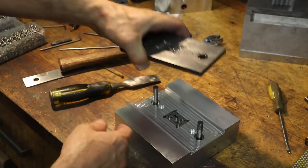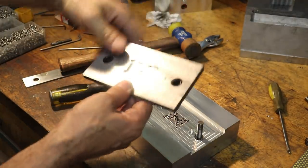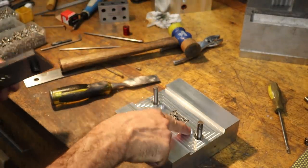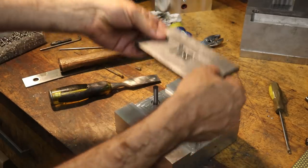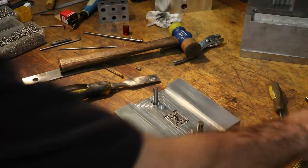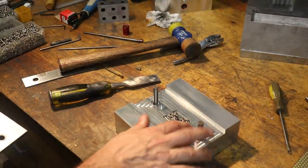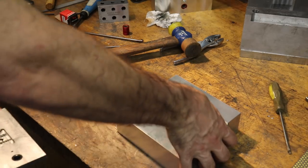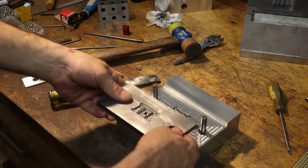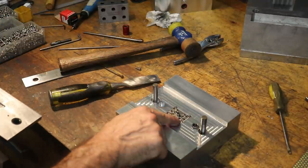This is the through hole that retains the stripper plate down. So when the mold closes, the A side of the mold is gonna push on this plate, and it's gonna compress springs inside of these pockets. And this plate is gonna seat down like we just did it, but I didn't have the springs in there for our test fitting. And this is one of the springs that's gonna go right in there. There's not gonna be much travel. Well, actually this one's too short. But there's not gonna be a whole lot of travel on this stripper plate. It's just to move up maybe 2 millimeters, enough to kick the part off of these little pins right here.